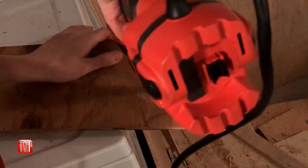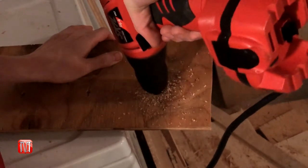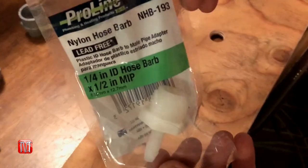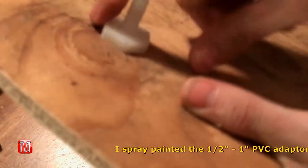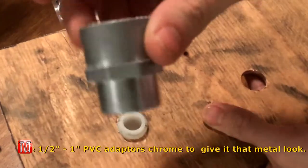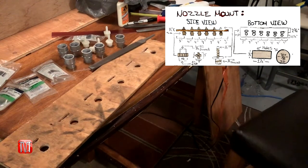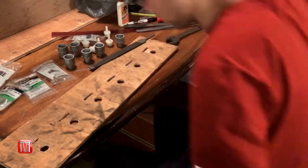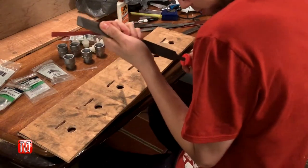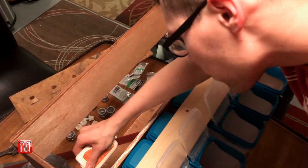Using a piece of quarter-inch thick plywood, drill out six half-inch diameter holes evenly spaced, two and a half inches in from one side. Here I have a quarter-inch to half-inch inner diameter hose adapter — thread the adapter through the hole, then thread a half-inch to one-inch PVC adapter to the other side. Once you know both adapters fit, it's time to drill and cut the slits for the switches. Each slit should be one and three-quarter inches long and a quarter-inch wide, evenly spaced a half-inch behind each hole. Cut the holes at a slight inward angle, then file each hole smooth and attach the hose mount to the frame.